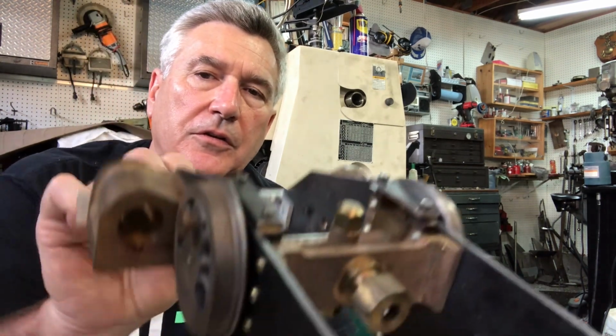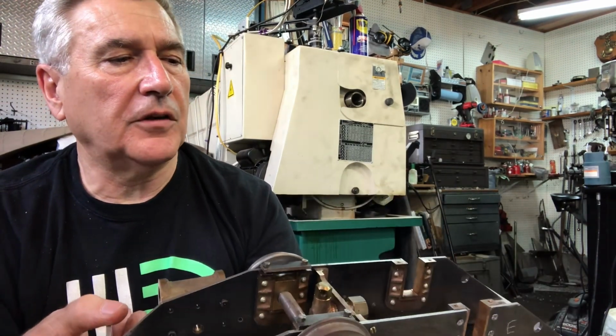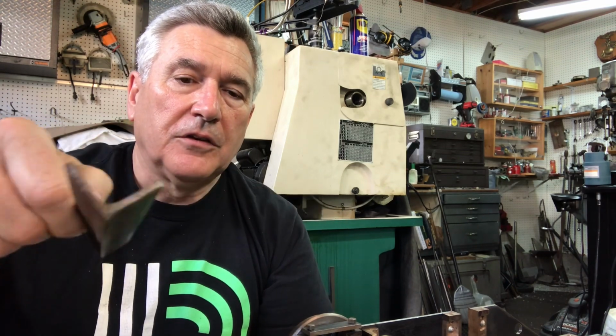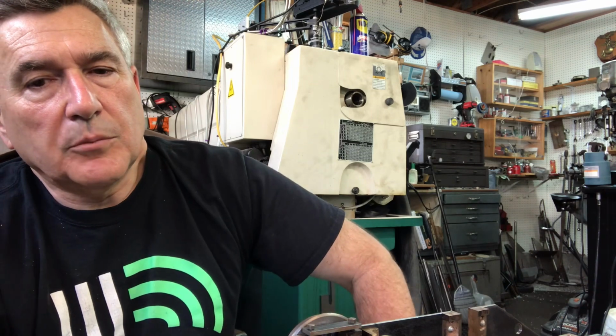And in the meanwhile, while I wait for those to arrive, one thing I'm going to do is, you can notice these buffer beams are aluminum, and the gentleman that sold me this set made the comment that anything you can do to increase the weight of the chassis will make it a better runner. So while I'm waiting for the package to get here from England, my idea is to take some steel angle iron. This is 1-inch angle iron, but I can mill it down to 3/4 of an inch. I've got a couple of pieces that will be very handy for that, and I can make replacements for the buffer beams here. That'll be a simple and fun project to work on for a couple weeks while those get here. Then when those get here, I can start working on the axle and the eccentrics.